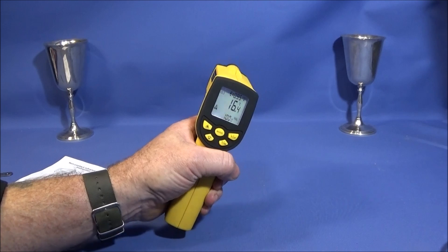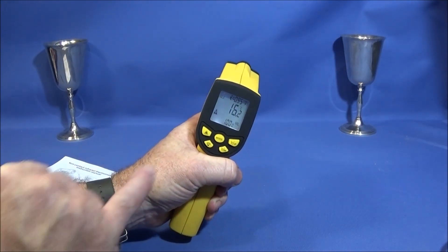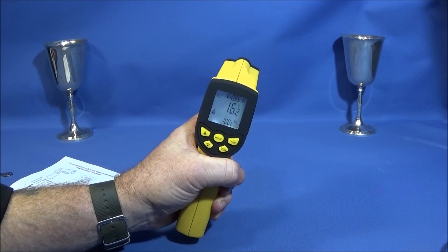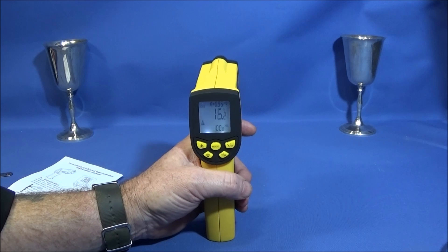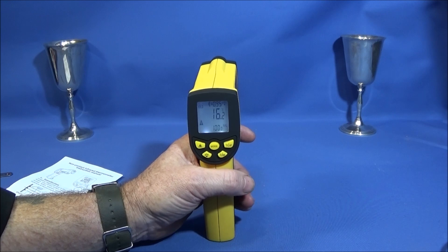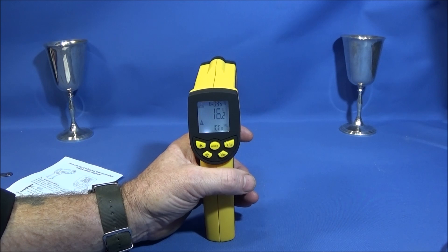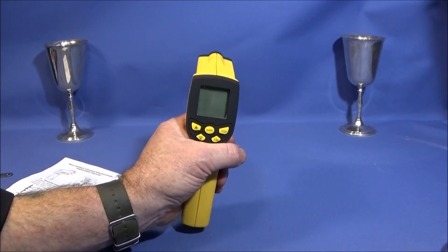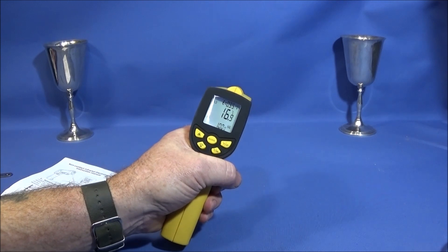That was a good test. The highest temperature I had it up to was 1140 degrees. Don't get confused with the display — the decimal point moves over as it goes up into the hundreds and then into the thousands — and it worked really well. That was with the actual burner going. Then over the course of several minutes I took several readings as the metal was cooling down inside the forge, so you can actually use this thermometer to test the cooling rate of metal.